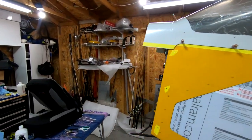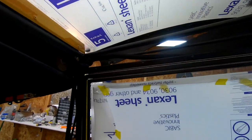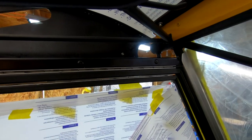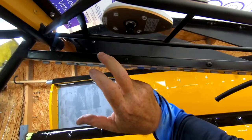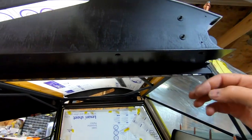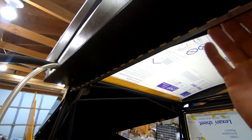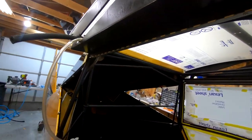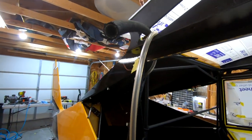Let me show you how I did those. If you take a look, I bent that on a 90-degree angle, riveted it in, and it slides out. Same thing here — here's the 90-degree angle, comes back out right here, and it's riveted. I've got five rivets there and five rivets across the back on this side. Those closeouts are done, painted, notched, looking good.